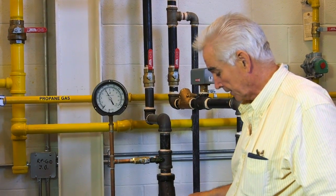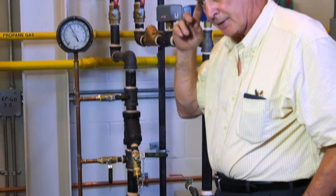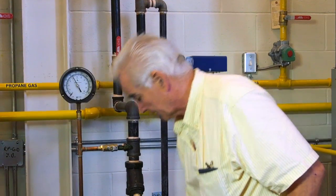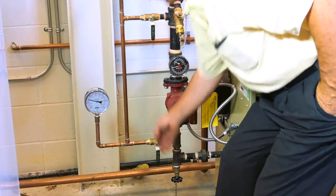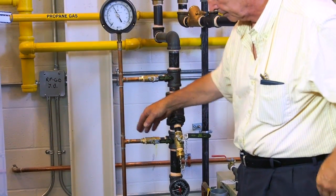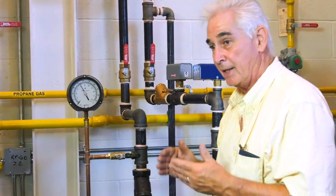So that's how to calculate pump performance. To see what size impeller it is, you do a deadhead test — shut the valve at the discharge of the pump. Open this valve to see what pressure you have there. Open this valve to see what the pressure is ahead of the pump. What's the difference times 2.31? That's the deadhead pump head.